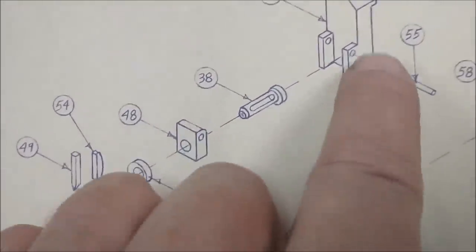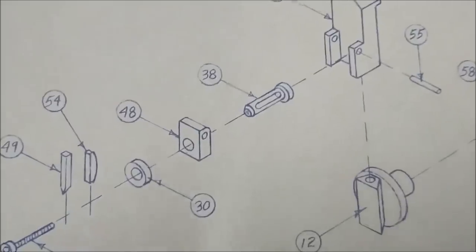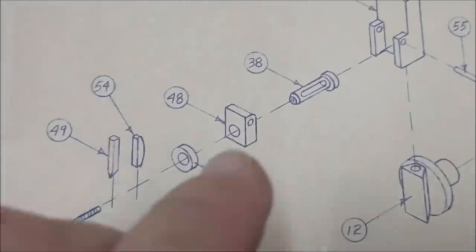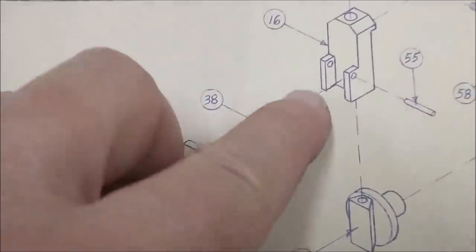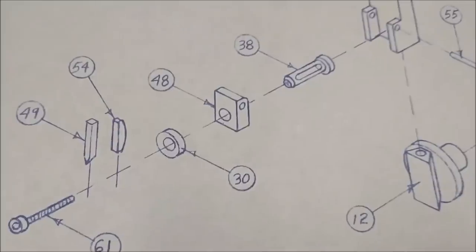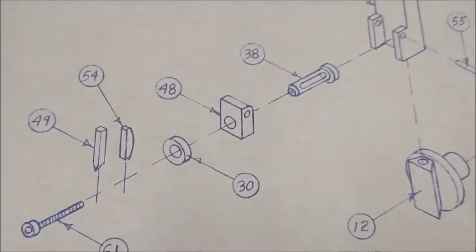Anyway, this piece is not very technical, but you do want these holes to line up with those holes and not pinch — it has to swing freely. And that's where the name 'clapper' came from, because as it rebounds it claps against the face of the tool slide. I think you're going to like the way this is done. This is an easy little part to do.